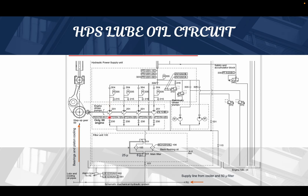These axial pumps are basically variable displacement type, swash plate type arrangement, which I will cover in the next video. The electrically driven pump is also the same swash plate type axial pump. The purpose of this pump is to develop pressure of around 200 to 300 bar, which acts as servo oil for the hydraulic cylinder unit for activation of the exhaust valve, fuel injection, and cylinder lubrication.